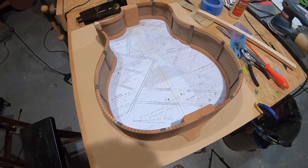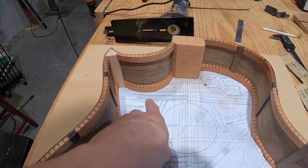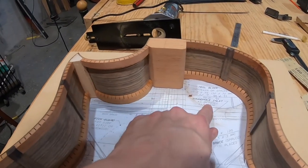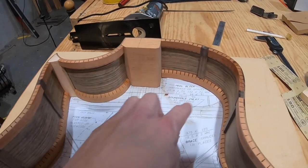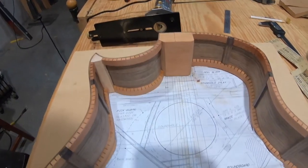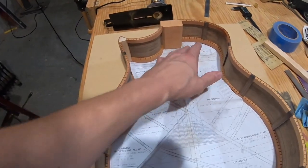One thing I need to take into account is the Florentine cutaway and where the braces come up there — I don't want to put the bracing on and then discover the Florentine cutaway is in the way. I've got the guitar rim set sitting on top of the plans. When I cut it out and made the Florentine, I tried to make it so the upper transverse bar could go all the way across and not be impeded. The only piece would be the tongue depressor up here, which may need to be installed after I attach the top so I can get it exactly cut and joined with the kerfing. Everything else will be fine, so I'll install the upper transverse brace and hold off on the tongue depressor.